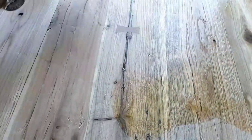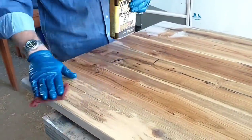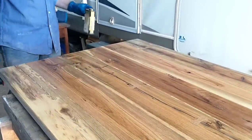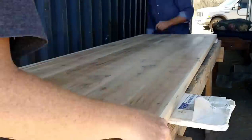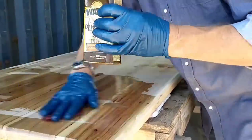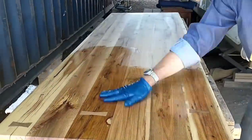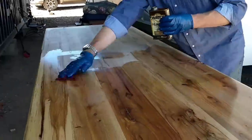We found that the oil brought out a lot of interesting color variation in the wood, and that the graying aging accelerator just washed everything out — turned everything different shades of gray. So in the end we decided to go with the natural color of the wood and use the oil. We're now applying the oil to the back of the tabletop. The oil is just the first step in the finish — we'll be putting on a polyurethane after this oil dries. So for now I just need to apply one heavy coat of this oil to both sides and allow that to dry. One coat will be sufficient to bring out the natural color, which is what we're really going for, and by only using one coat it'll also dry faster. This oil is such a fun process — it gives us our first glimpse at how the table will look, and these bow ties really look nice in here too.